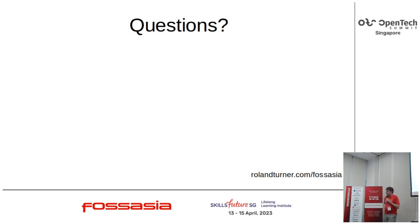Sorry, didn't really get the bit about EMC. So is it an emissions requirement? Emissions and acceptance. Okay. So if you're looking for benchtop EMC, one of the things we used a TEM cell for was torture testing. You put a device in a TEM cell and then you put a kilowatt of power in it, and the device has to not malfunction. So for example, if it contains a transmitter and a microcontroller, the microcontroller must not, as it were, dying is actually okay. What it must not do is select an impermissible frequency and begin transmitting just because of the presence of some of it.